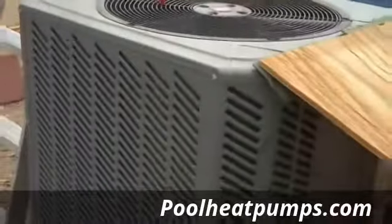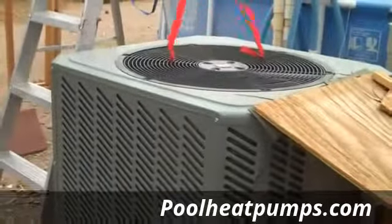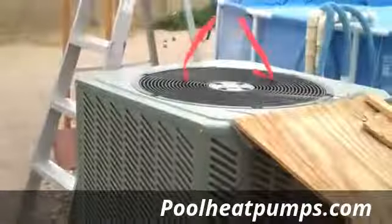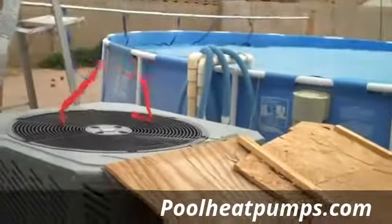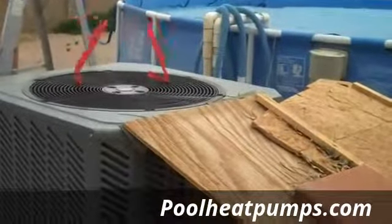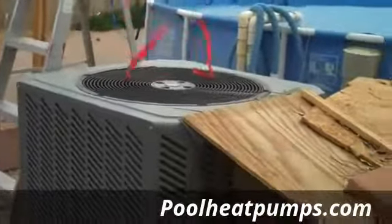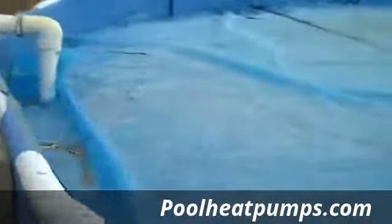They do work a little better if you have more humidity, because there's a bit more heat to extract, giving slightly better heat transfer. But it is not a big difference. I usually have 10 to 20% humidity out here, and compared to when my humidity goes up to 70 or 80% after desert rain, there's not a real noticeable difference in how much heat this unit puts into my water. It works fantastic, and the proof is in how well this pool is heated.